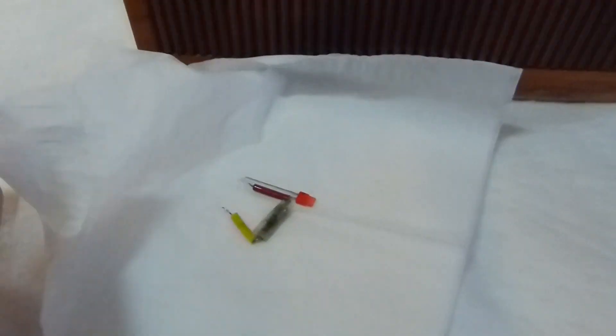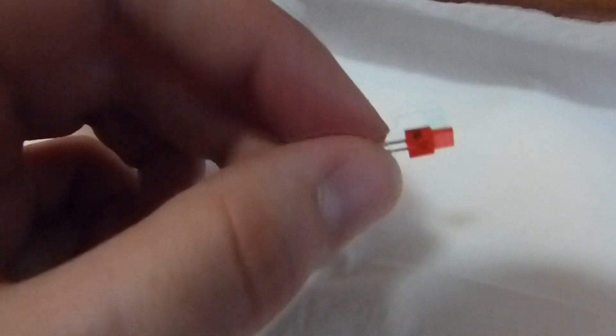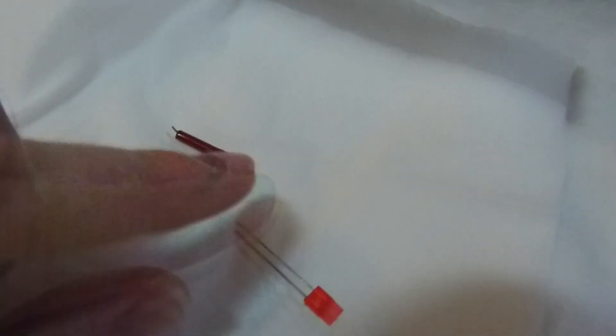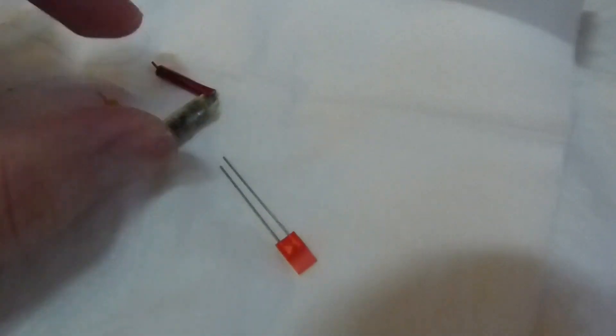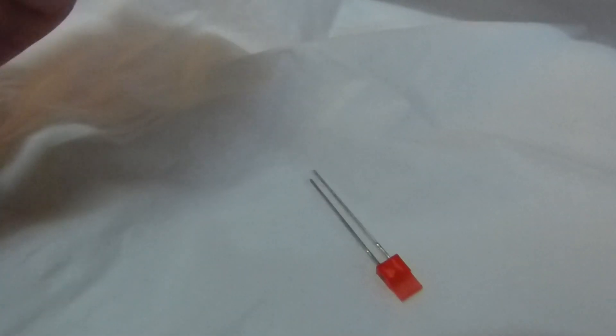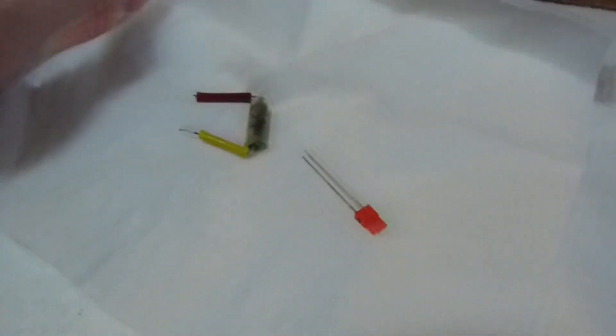So if you need to repair one of these, just find an older LED that drops 1.8 volts, and the positive lead of the LED goes to the positive marking on the board. You don't need an additional resistor or anything else — there already is one for the old-style voltage stabilizer.